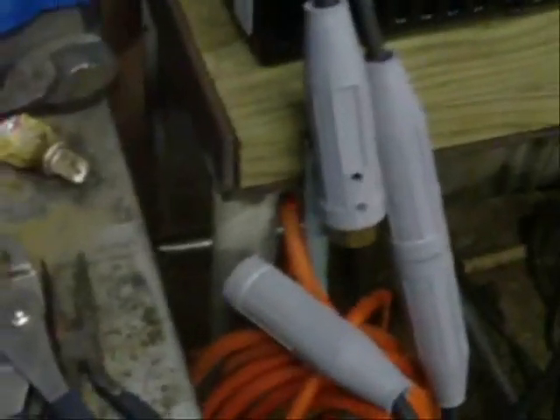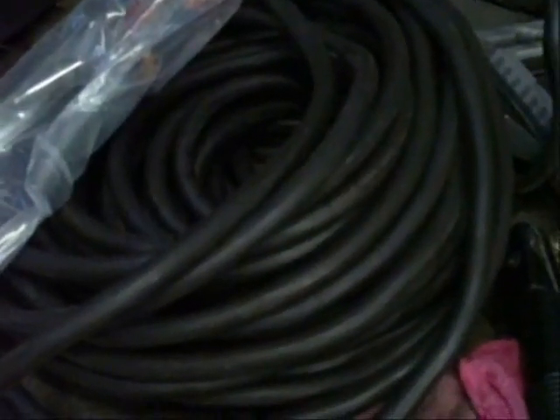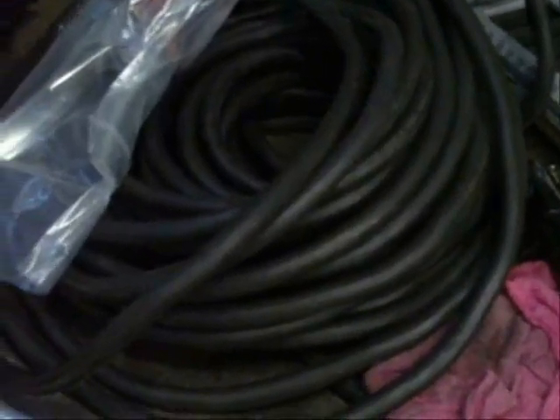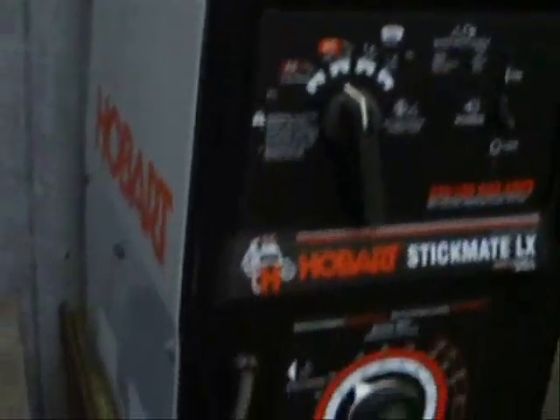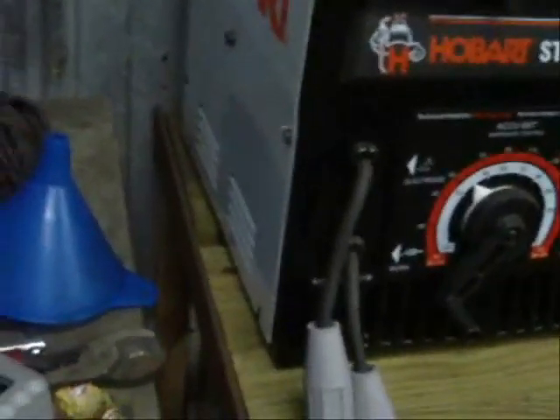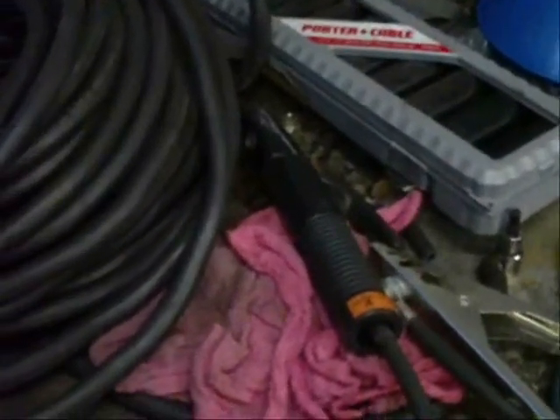That is, I want to say, a hundred foot of cable. Yep, a hundred foot of cable — I paid $225 for it. I'm going to cut it in two and make two fifty-foot leads, which would be plenty enough to reach from inside the shop to outside where I want to weld on trailers or whatever, instead of having to tote this heavy machine everywhere. This thing just kills my back every time I have to move it. So for $225 plus whatever else, less than $250 bucks, I'm going to have two fifty-foot leads.